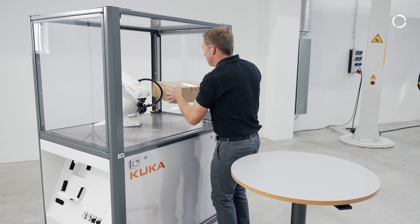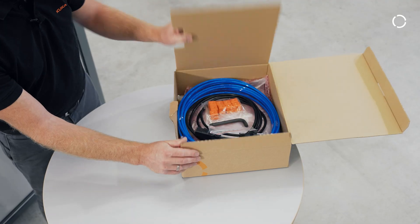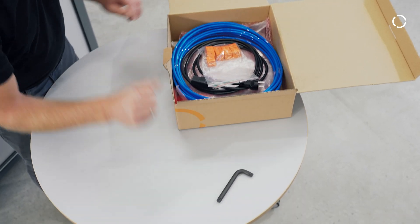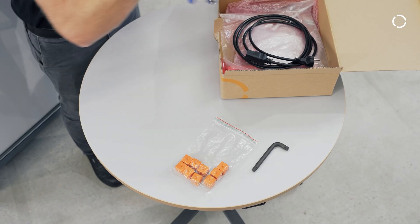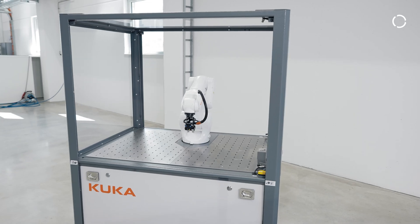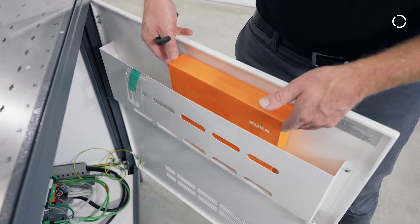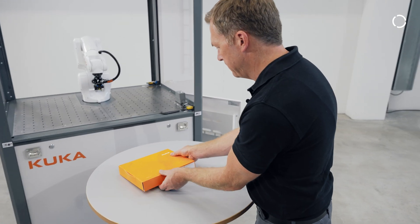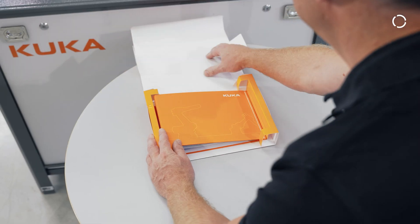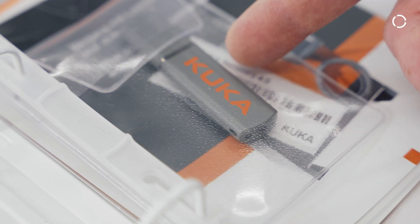After opening the sliding windows we have access to the cardboard box next to the robot. It contains a Torx 55 key, 10 cubes, the pneumatic and electrical connection cables, and some additional accessories. With the Torx 55 key you can open the cell's back door, where you will find a box called the media kit. Additionally there are hard copies of the safety instructions and the declaration of conformity inside the back door. On the USB stick inside the media kit you can find all required user documentation.